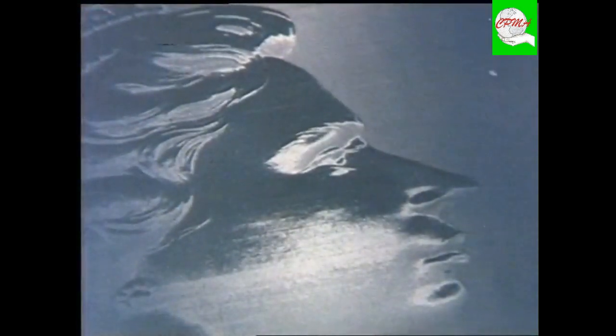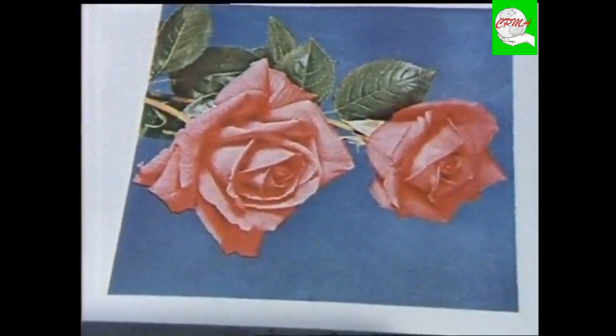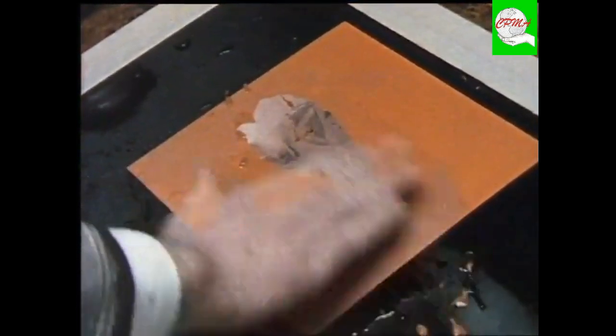The fact that a laser will cut grooves of a precisely determined depth and separation has suggested a way of updating one of the largest of our industries. The color is laid on the print in the printing press by a combination of ink and copper plate. In it are tiny wells which hold the ink, and it's their depth which determines the intensity of the printed color. The problem is that the present method of etching the wells in the copper is laborious and expensive. But it's been in use since the 19th century, so it took a piece of radical rethinking to bring it up to date.